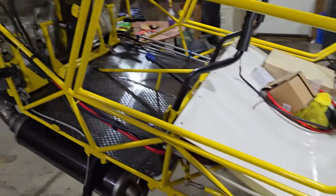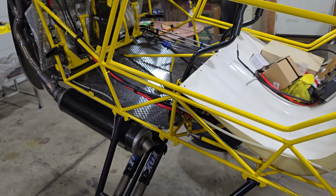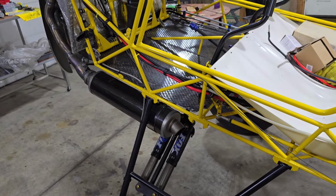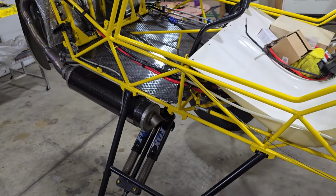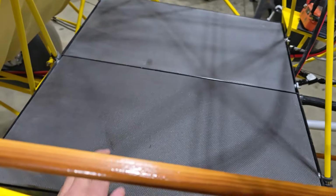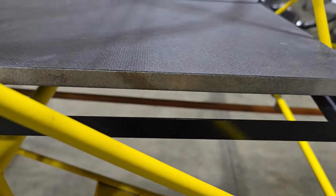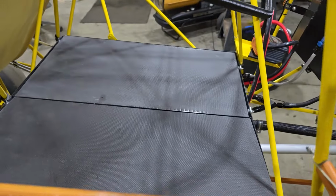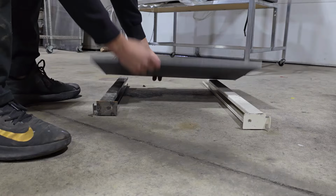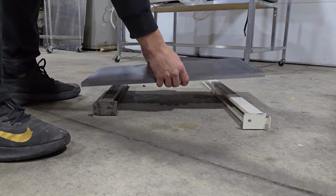Everything that's carbon fiber in this plane, I built. I didn't buy anything. I hand laid all these sheets, vacuum bagged it. I took a bunch of pictures and video. I'm hoping to put some in the video here. Even my baggage compartment. These are foam cell with carbon fiber skin, very light. Okay, this is that same panel. See how light it is?